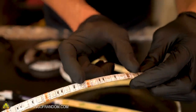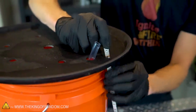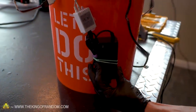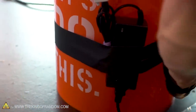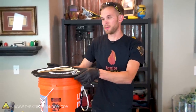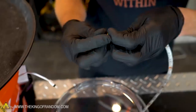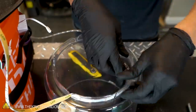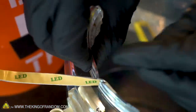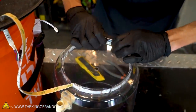These LEDs are designed to be cut every two inches or so, with a little mark indicating where. I'll give myself about a foot extra and that's where I'll cut it off. That fits nicely up through where we just drilled a hole. I think the best position is going to be for the control box to be vertically up and down next to the bucket — I'm going to use some tape to secure it in place. I'm leaving a fair amount of slack in our LED line because I need to be able to lift the tray a little bit without immediately disconnecting everything. This lighting system is actually waterproof. It's not good to get any of the control box pieces wet, but that shouldn't be a problem.